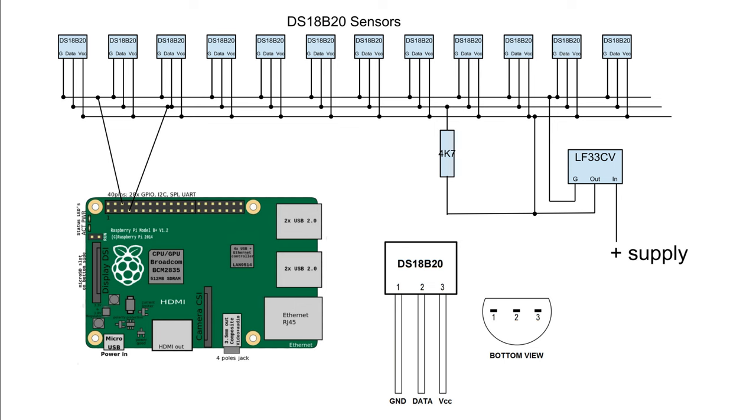This may not work first time, and it didn't for me. Commonly, when small board computer systems don't work properly, marginal power supply is the problem. So that is one place to look, and is how I came up with my power supply scheme.